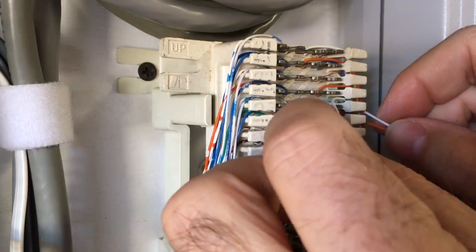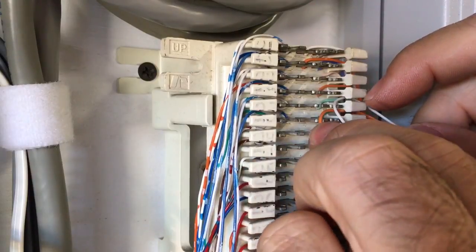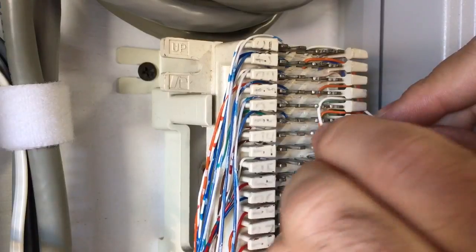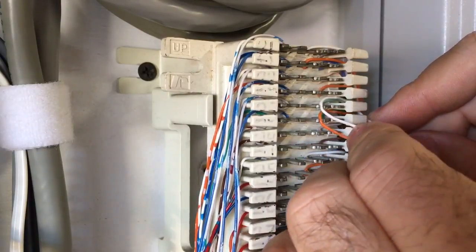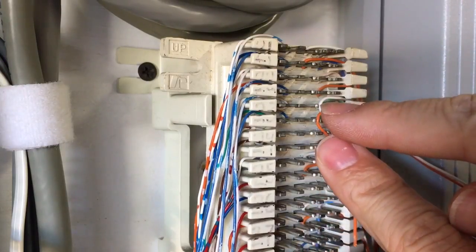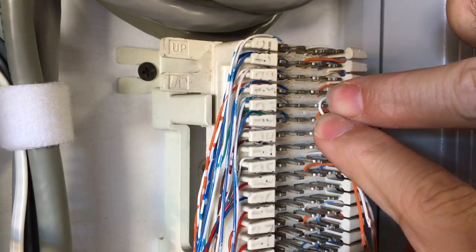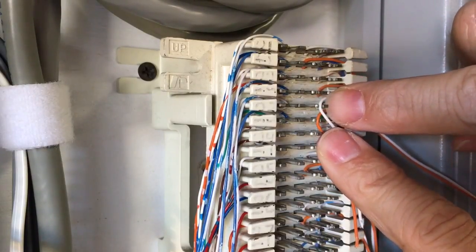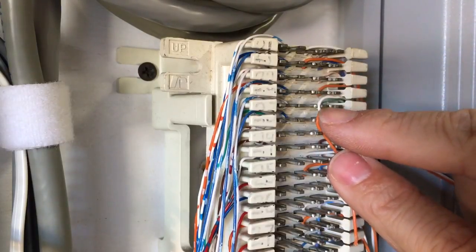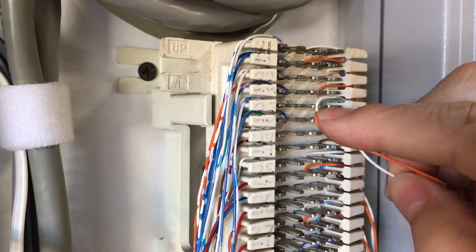Inside a 66 block, in the pins, there's a little groove — a very tiny wedge that goes right down the middle. You want to take your wires, lay them inside the little plastic guides, and then guide the wires individually down into those grooves. Basically, the metal acts as a pinch: as the wire goes down into that V, there's a crushing action that strips away the plastic insulation and bites into the copper, making an airtight seal with the copper wire.